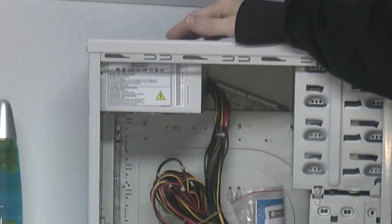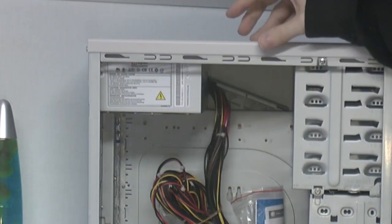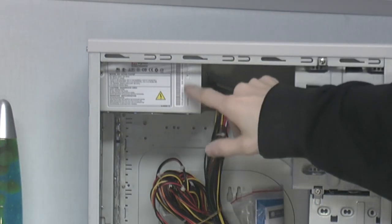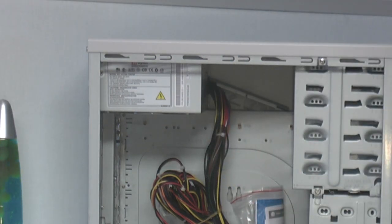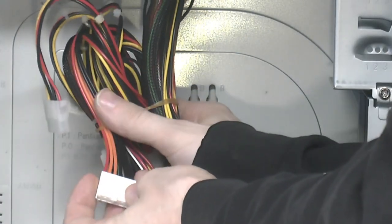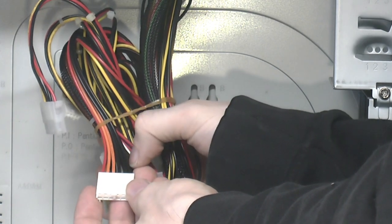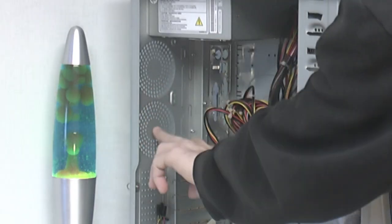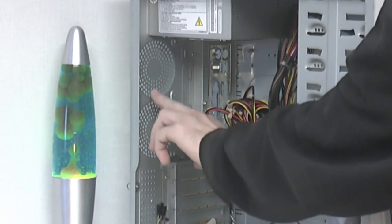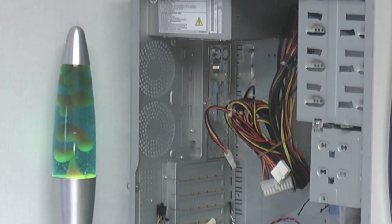So this thing comes with a power supply. I read that this should be an FSP, maybe. The topology is probably the same. So our power supply has the 6-pin AUX connector here for 5V, 3.3V, and 3 grounds. At the back here we have two 80mm fan slots. The perforation isn't that great, but it's kind of typical for old cases, I guess.